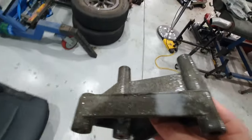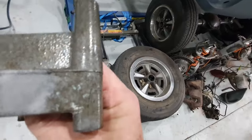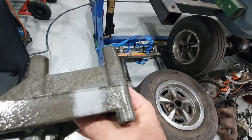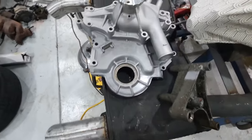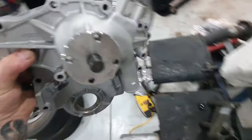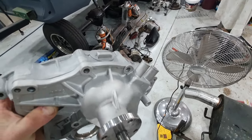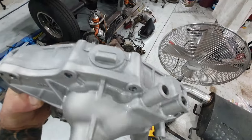There you go — in better light you can see the difference between that gummy old gray bracket and what the vapor blaster did to it, and that's only the first pass over it. Earlier when I first put this together I actually vapor blasted my timing cover. I bought a brand new water pump and the brand new alloy was looking a little different, so I put it in the blast cabinet to try and match the finish. It's got a nice glistened finish to it — like a metallic sort of finish. It looks pretty good, I'm pretty happy with it.